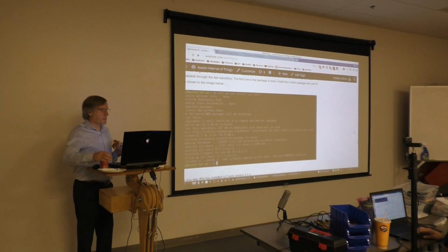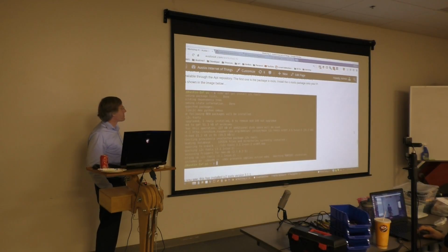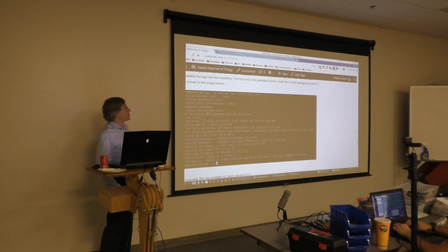Now, I think that was a dependency of the SMBus. So, I mean, although you install it, it may not be needed. We'll see. Yeah, whenever you install python-smbus, it says the following additional package will be installed: i2c-tools. Right. So that's a dependency of the Python SMBus. Oh, so we've already got this installed. You should, but it won't hurt.